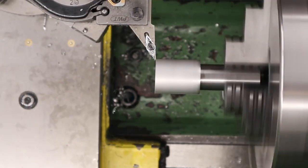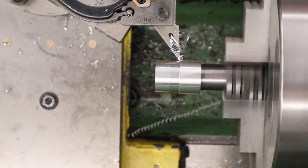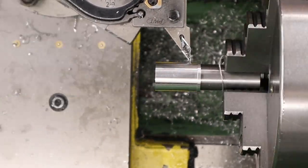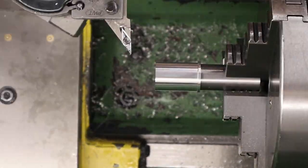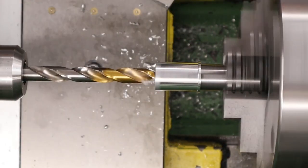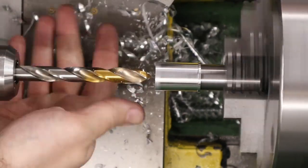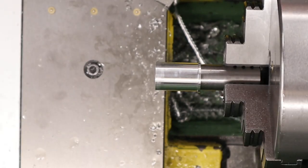It's much nicer than holding the part by the threads you just cut. Once the mandrel has been indicated in we can screw our part into it and start turning the external features. First thing we'll do is take the OD down to 23mm — that's the OD of the carbon we're going to be using for this shroud. We are going to be making two parts in this setup: the first being the end cap for the shroud with a half inch UNF, and the second part being the front shroud support. This will screw onto the half inch UNF of the barrel and have O-rings on the OD that will locate the carbon fibre tube and keep it central to the barrel. The two parts are going to be turned down to a nice tight fit in the carbon tube.